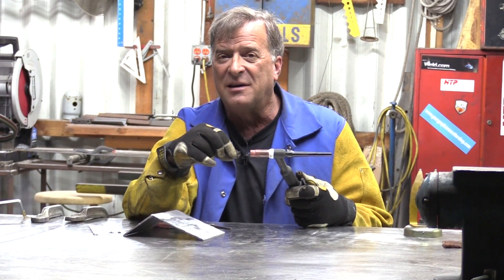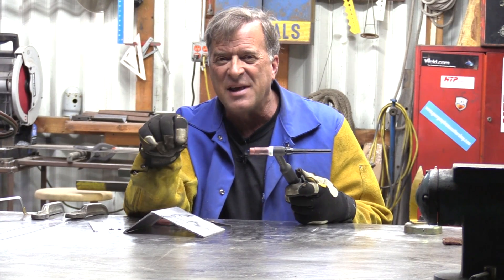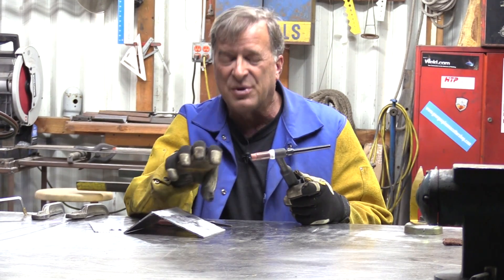When you're going to stick your tungsten out a little, you bump that gas flow up just over a quarter turn, an eighth of a turn — just something to compensate for the fact that your tungsten is sticking out a little bit. Put a little more gas down there. That's why it turns blue.